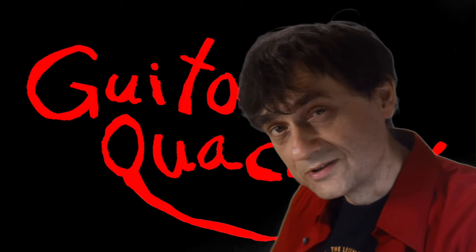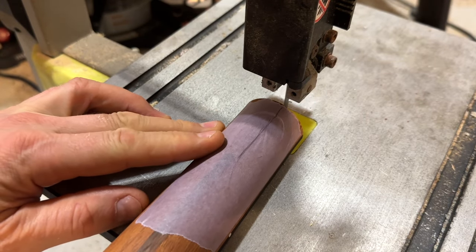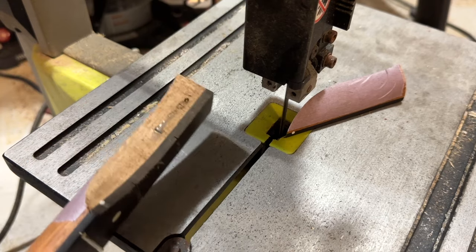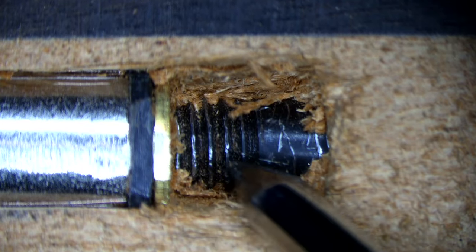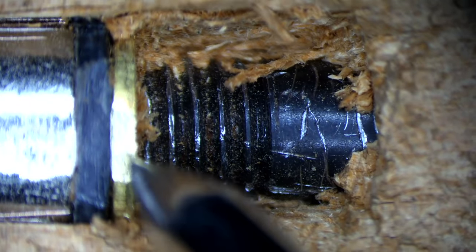There's going to be some bonus material — it's going to be a neck autopsy. I haven't even told you what's wrong with the neck yet. I don't really know, which is exactly why we're doing a full guitar neck autopsy. I just know the truss rod did not work. The first thing we want to know is whether the truss rod was maxed out. Looking at the remaining threads of the truss rod, we can see it is in fact not maxed out — there are quite a few threads left behind the anchoring point, which is this brass piece.